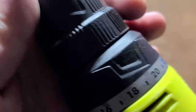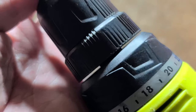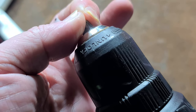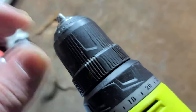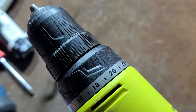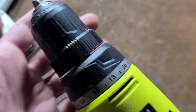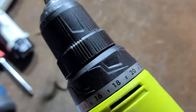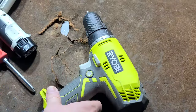Back to the spindle — since this one is plastic, and I noticed that on my D43, I'm grabbing right on the chuck teeth. It's not too bad but there is a bit of spindle wobble here, just a little bit because the bearings on this are really close together, so they don't provide as much stability. I believe the gearbox is going to be plastic in this, as it was in the D43. That plastic can stretch, allowing the spindle to get even more play into it.